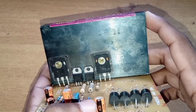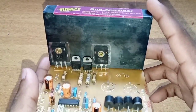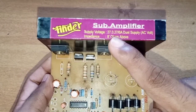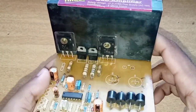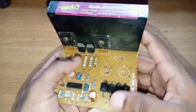At the same time, the overall performance is good — it can deliver over 200W. On average, the whole board is useful. We have great power. I am using this board with 8 ohms as a user. If you are using 4 ohms, more heat is generated and there is a risk of damage. If you use the minimum components, then you can use this board.